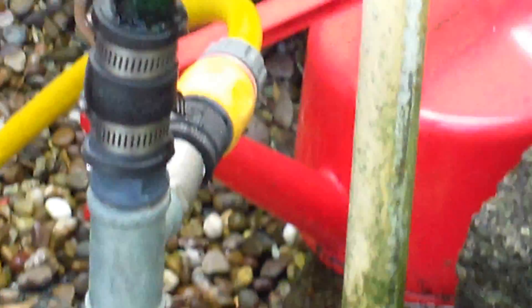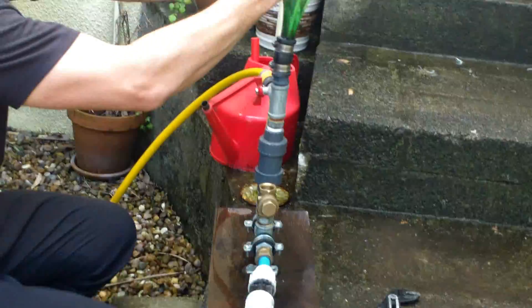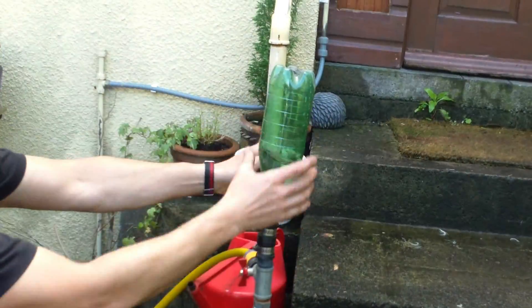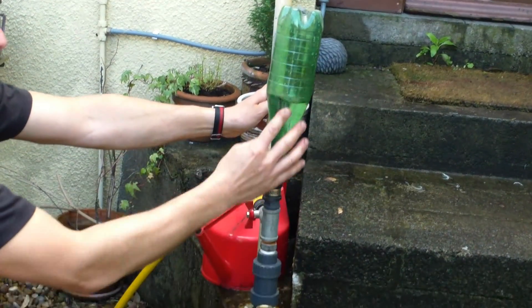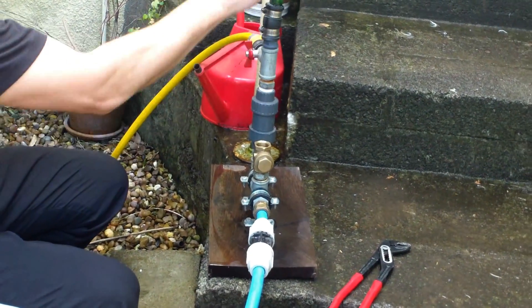It's forced up the non-return valve and it comes up into this — I've used just a plastic one and a half litre bottle. This is my pressure vessel. So the water is forced up the non-return valve, and of course this is under quite a bit of pressure. The water is forced up into here, non-return valve — the ball drops down so the water cannot get anywhere.